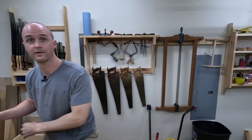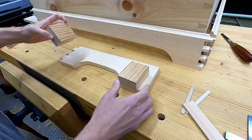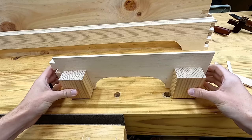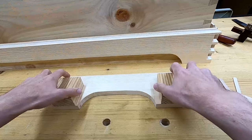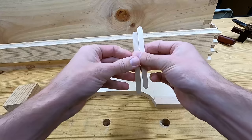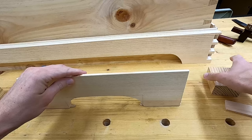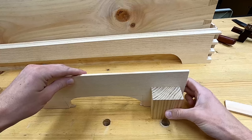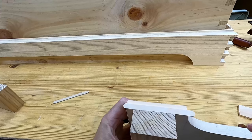So how can we do that for furniture? Still using glue blocks, but not the way most people use them. These glue blocks, when glued onto the side trim, are going to transmit the force directly from the ground up into the chest. We can do even better with the help of a little popsicle stick. Setting the trim board down on top of those popsicle sticks — or spacers, whatever you've got laying around, just make sure they're all equal thickness — and then placing the glue blocks gives a perfect amount of offset. Just that little amount right there makes all the difference.